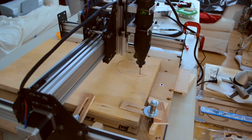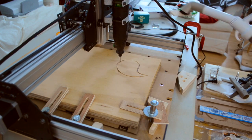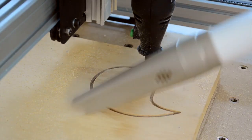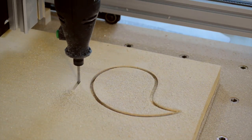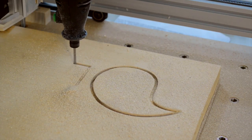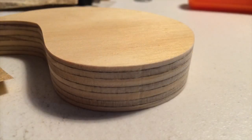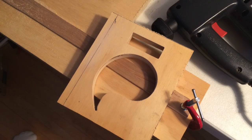The cutting parameters were pretty similar to what I've used before: cutting depth of 1/16th of an inch, feed rate of 10 inches per minute, with a straight flute end mill. We did one test run in some scrap pine before moving onto 3/4 inch plywood. The end result was very good, with the edges coming out cleanly and the center cutouts separating without any drama. Take note of everything that went right on this project, because it's in stark contrast to what happened later.